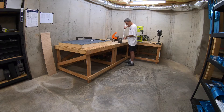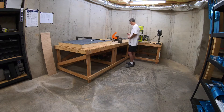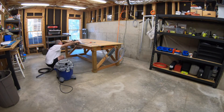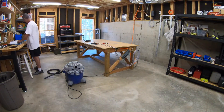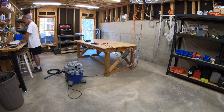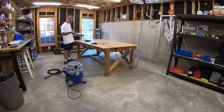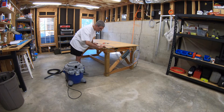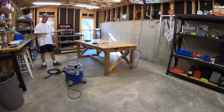I'm checking it with a straight edge and I'm really happy with how straight it is. Now I take it over to the 3M wheel, removing any tooling marks and doing a little deburring on the other edges as well. That'll be just about it for this part — I do a little bit more with a 3M Scotch-Brite pad to smooth it out. Then this one's done and I move on to the other spar cap, the other side.